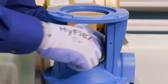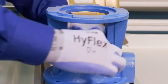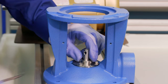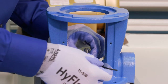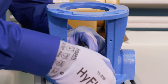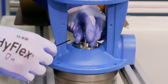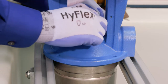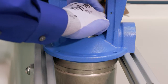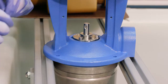Now we're removing the seal plate. We have to break these screws loose, and we'll use them to push the seal plate out. But before taking them all the way loose, there are three smaller Allen set screws that lock the seal to the shaft — we just need to loosen these, not remove them completely. Once loosened, the seal will slide off the shaft with the jacking screws.